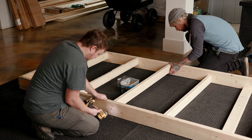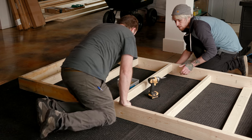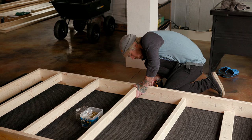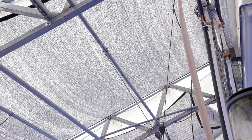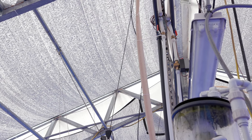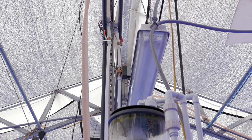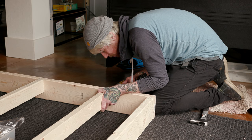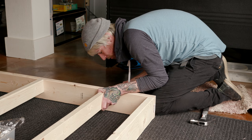The new hanging canopy is made from a combination of wood and ABS. The wood is essentially the frame, and we got a 4x8 sheet of ABS to sit on top. That's pretty necessary out in the greenhouse because there's a lot of drips and things that happen, especially in the wintertime when there's a lot of condensation. You can imagine the cold structure hitting that humid air immediately causes condensation, so at different times there will be rivers of water coming down the different galvanized steel structures. Having an ABS top allows all that water to just run off and not hit our new lights.